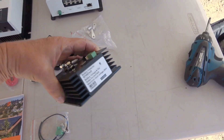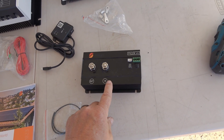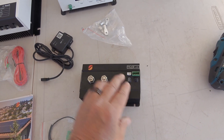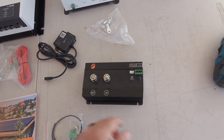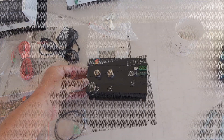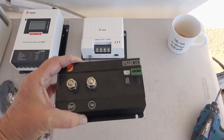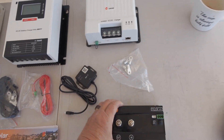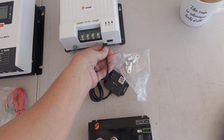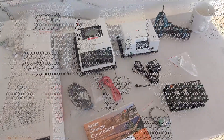Then there's what they call a battery protector. Looking up the manual online, it looks like it can prevent your batteries from becoming too discharged by cutting off non-essential loads. It can also be used to protect lithium batteries — two different ways to hook it up. It can also function as a battery switch to turn power off, and this one is rated at 60 amps. And then we have a Wi-Fi dongle, which can plug into the components and give you app access to the settings.